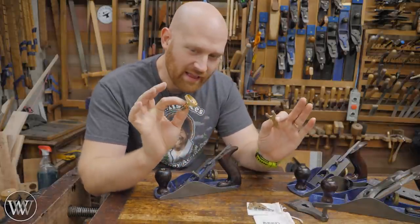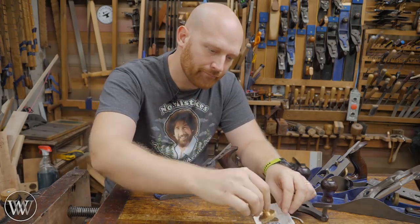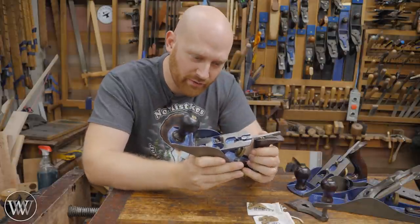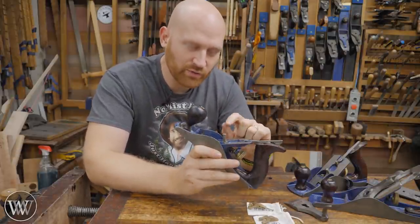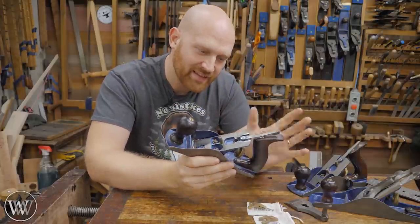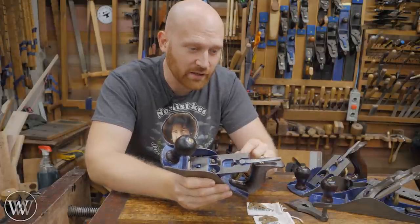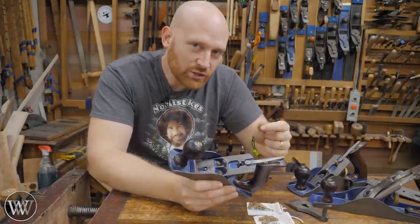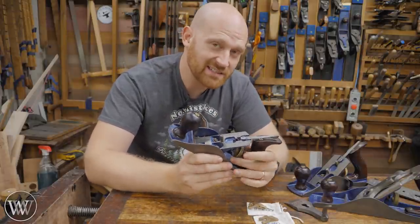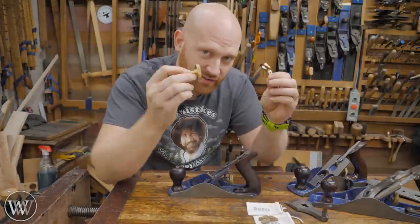First off, I have to say these are not necessary parts. They are parts that are nice, but you don't need them. With a standard Stanley Bailey plane, you can tune this to do anything you want it to do. It takes a little bit of work, but you can really tune this in and make it do amazing things. The difference between this and a high-end plane is the fit and finish and the fine-tune adjustability. A nice high-end plane will allow you to do things a little bit easier. They feel better, there's less slop in the pieces. And a standard Stanley plane has a decent amount of slop — it doesn't feel amazing, and it takes a little bit more work. These parts fix that.